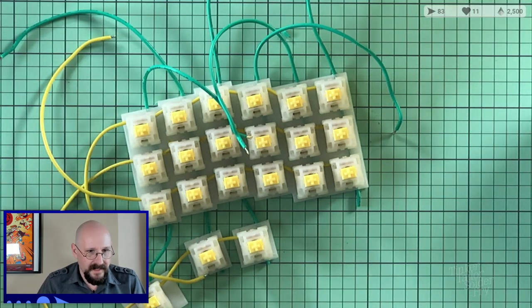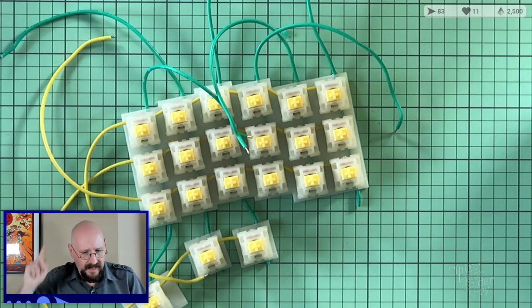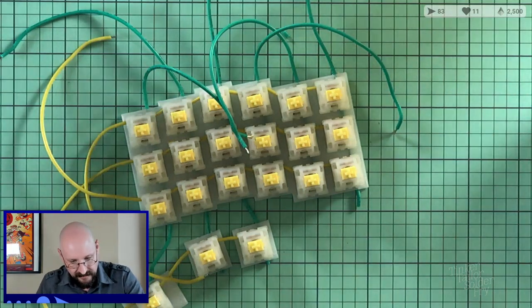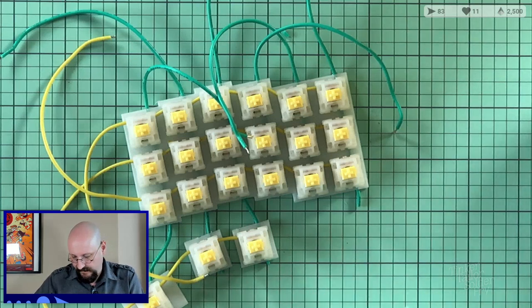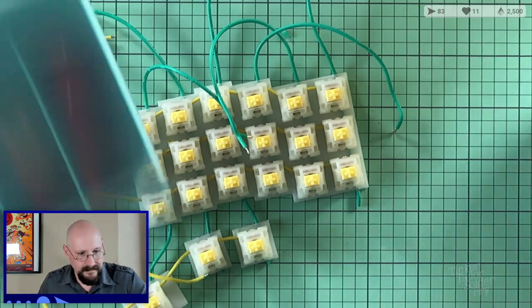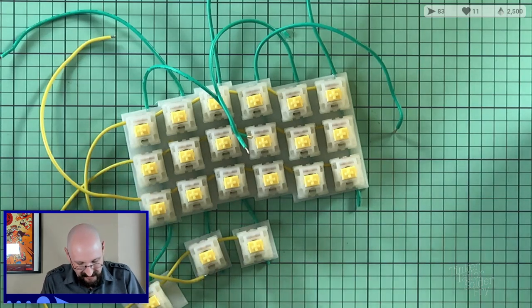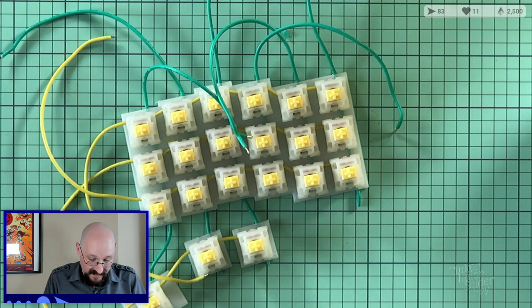Let's see, Ethelatorian says, with mechanical connections, random strips and flicker. Had to solder everything to get things to work, except for the last section, it never worked. That's sad. I recently replaced the overhead light in my kitchen. It was an LED thinger. It doesn't look much different from your frames and what was there. And everything inside those was soldered. So I figured that's probably the right thing to do, is soldering.